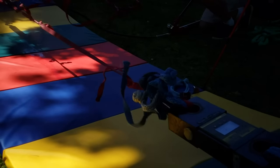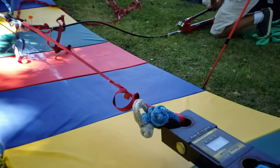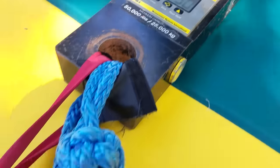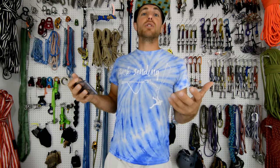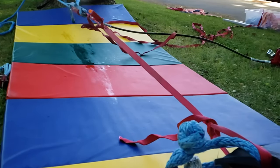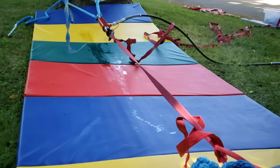With Type 18 we tested four, six, eight, and ten bar tacks. Four bar tacks gave us 13.1kN, and when we put the tail of that sample into a WebLock and broke the other sewing loop, it broke at 12.6kN — a little less than the first test. I believe it broke less because we stressed it so much during the first test that it weakened it about half a kN. Six bar tacks broke the stitching at 16.5kN, and when we put it in a WebLock to break the other side, that also broke at exactly 16.5kN.